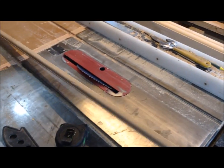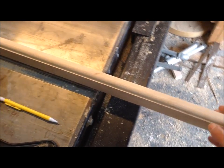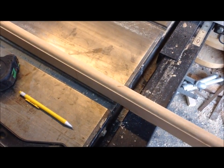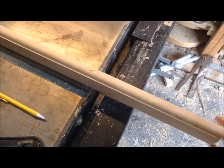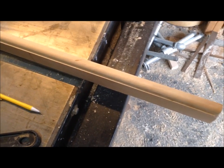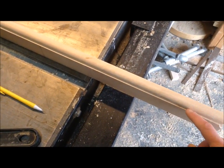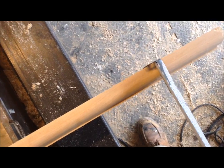I ended up making four pieces of molding — two for the bottom and two for the top, though the top will be a little different. If you don't want to custom make your molding, the only reason I'm doing so is because it has to be birch. You can finish this off with pre-made molding from the store, and if you're painting it you could even get pre-primed molding. The assembly will be the same whether you make it or buy it. This was four-quarter lumber, 10 board feet, and I'm using it straight out of the package, so the molding will be a little chunky — about three-quarters of an inch versus the five-eighths you'd get from the store.